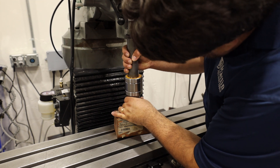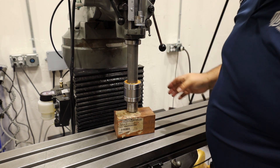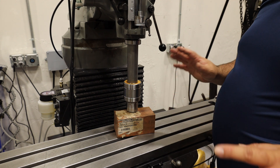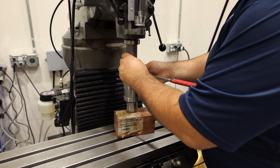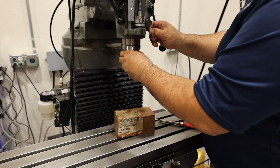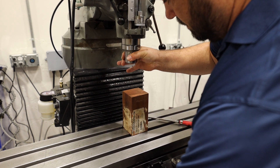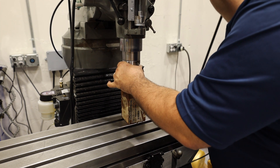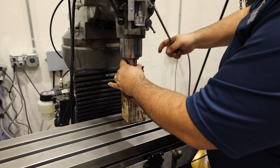We're not going to use the table to drive this thing home — it's a little dangerous. Instead, we're going to rely on the quill to drive this thing home when we're ready. Excuse me for the next few minutes while we try to line this thing up. Now I'm just going to bring the quill right here — notice it's going in really easy.